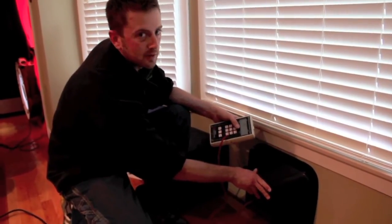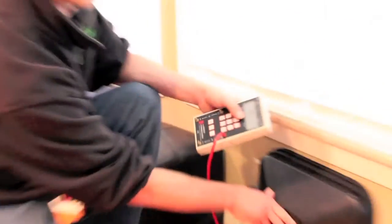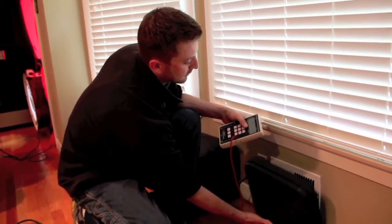The number I'm seeing right now is actually 11, which is pretty bad. It means that it's open to the outside somehow, and the higher the number, the more leaky that particular supply or return duct is. That's a concern we'll have to look at later.